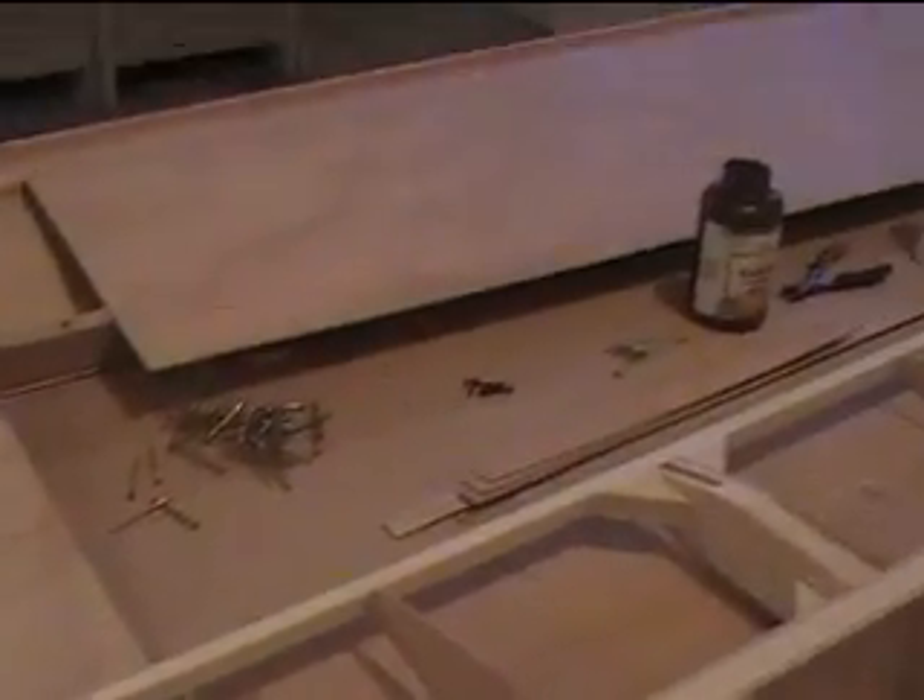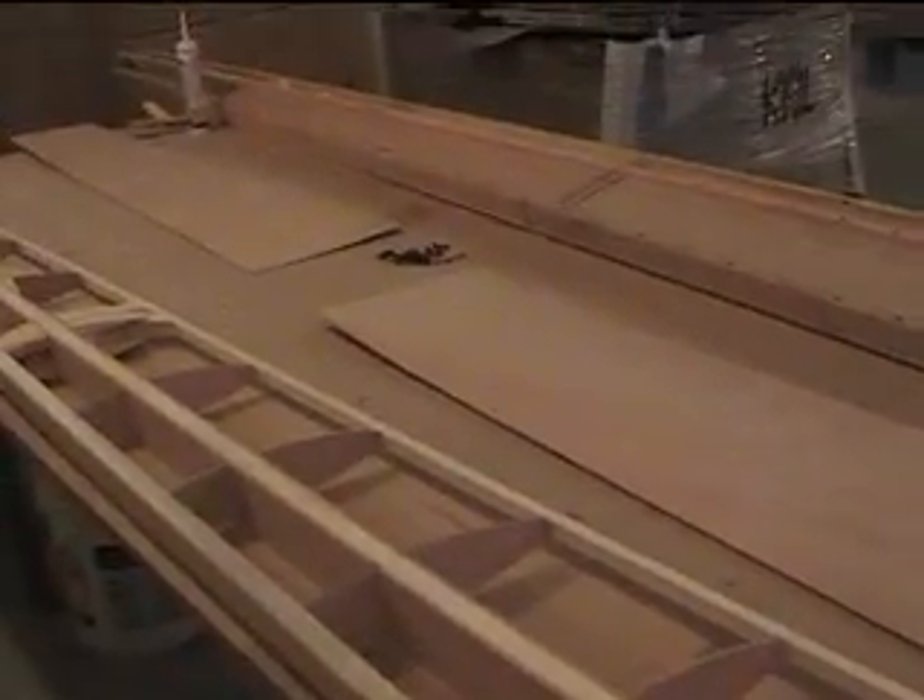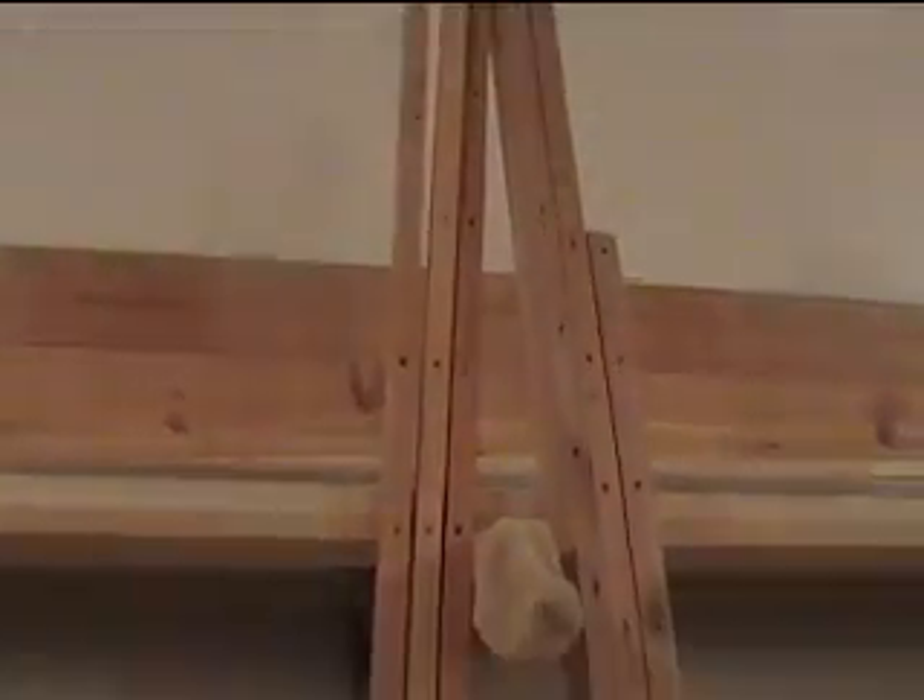The skins are sitting right here on the table ready to go. What I'm using to fasten them down with is these batten strips that are 8 feet long, 3/4 inch wide by 5/8 inch high, pre-drilled every 5 inches — some of them every 4 inches. On the trailing edge I'm using these 3/4 by 2 inch straight edge guides, which help keep the trailing edge straight, which is the hardest part because it's kind of thin.